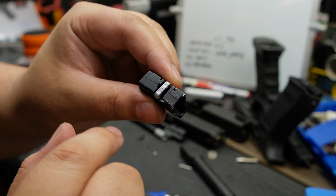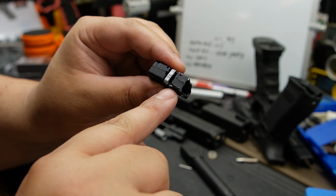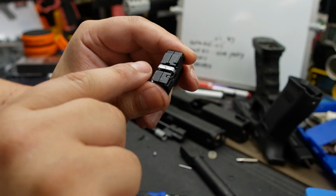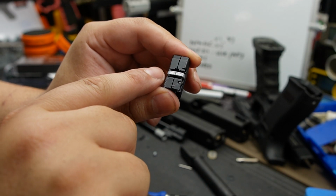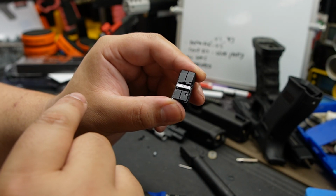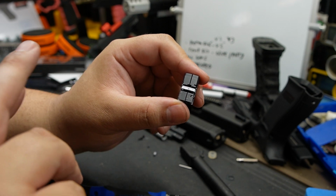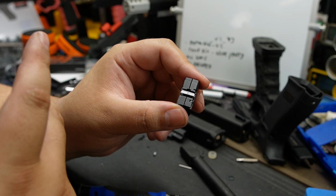Okay. My idea is to bring this screw over here as well. So I'm just going to use 2 of the same screw, and I have to thread this. The only problem, this size is oversized. I'm either thinking I just put some steel epoxy in there, let it set, tap it again, because it doesn't need to be like amazing, you know what I mean?